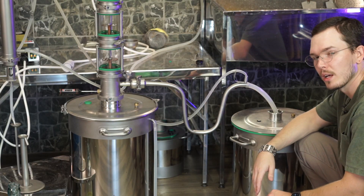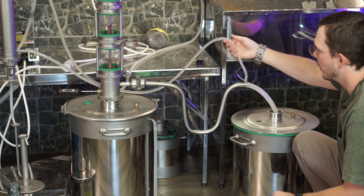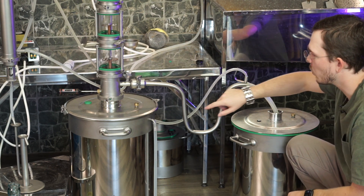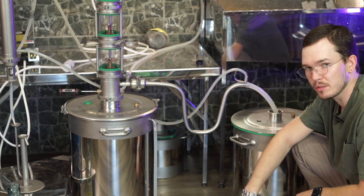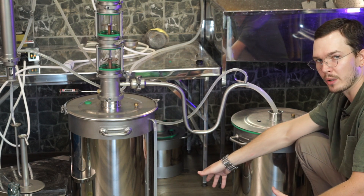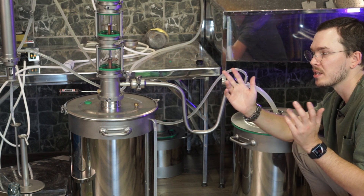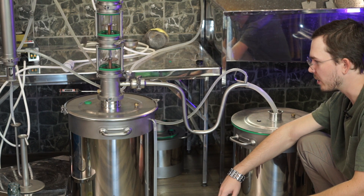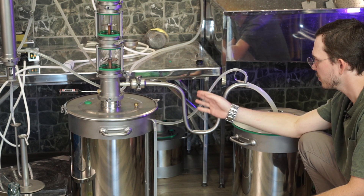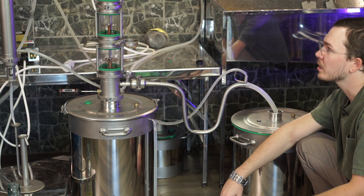From this view you're probably able to see everything. Here I have a hose with hot water from the product condenser. Hot water mixes with the spent mash from the continuous column, so we don't have 100-degree mash on the floor or in the bucket. We're mixing it with hot water to get a lower temperature so it doesn't vaporize in the room where you're working. Pretty cool stuff — this is experimental and I'm just trying to figure out how well it works.